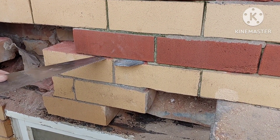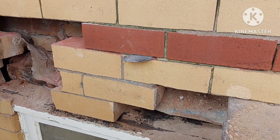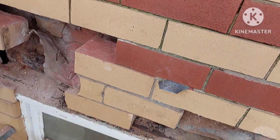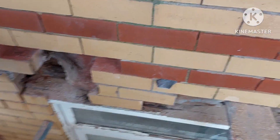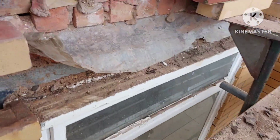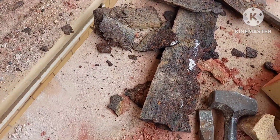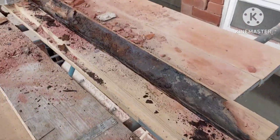At this stage I was thinking about maybe going and getting another prop and trying to push the brickwork up even more. But I was a bit concerned that the brickwork, with it being bulged, had burst out and we'd end up losing the building. We managed to get the brickwork out. There was immense pressure from the iron lintel that was in there. There's remnants of it there - rotten as a pear. It's a rotten old building, this. And that's what's left of it there.